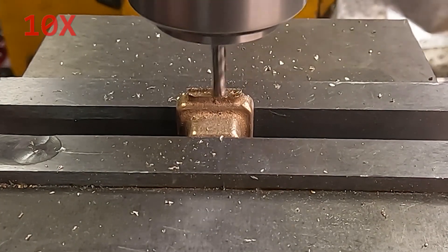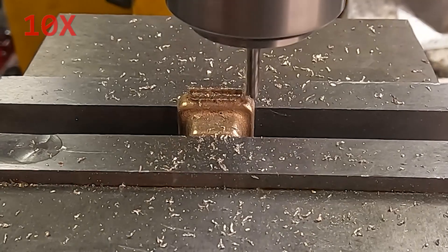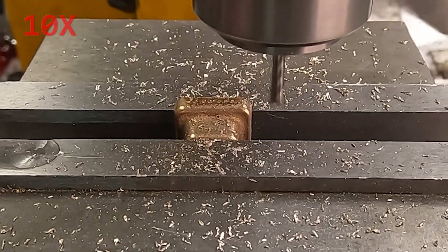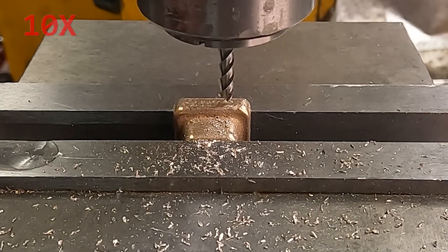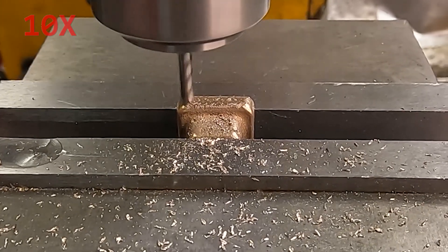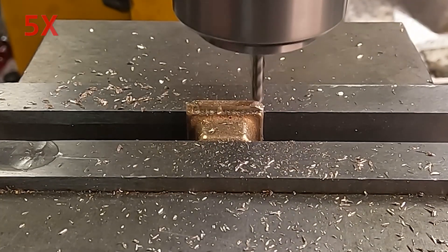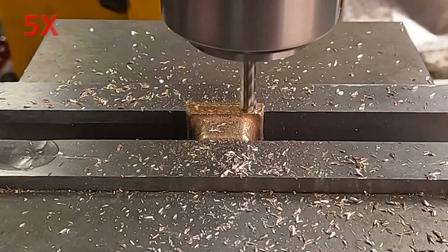For the valve, I have already sanded off the back — which is the working surface of the valve — on the surface plate, and here I'm just taking off the casting sprue. The other side has been filed so I've got it pretty square. It's in the vice here and then I'm going to take my zero which I forgot on the previous pass. Then I take it out and measure it, figure out how much I have to take off, and I'm going to take off the same amount on both sides, turning it round as I go, and take off the other sides as well.